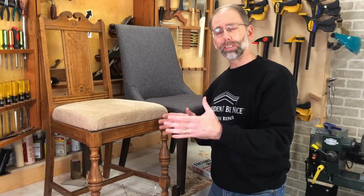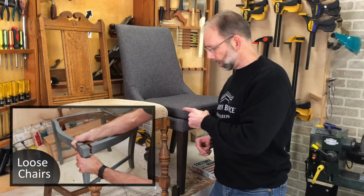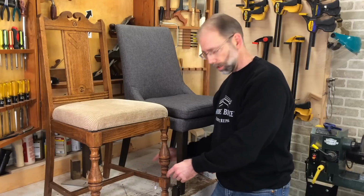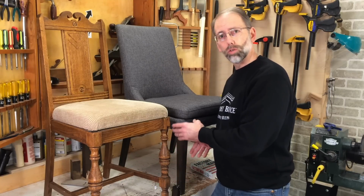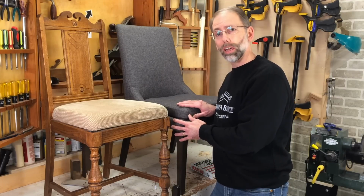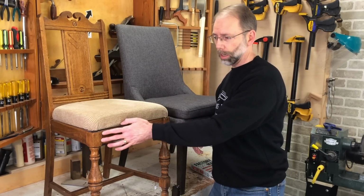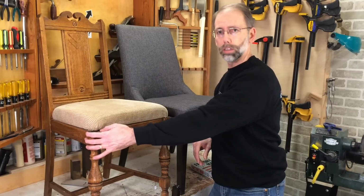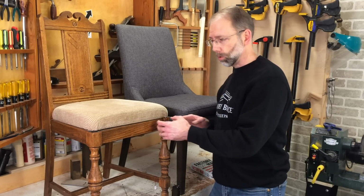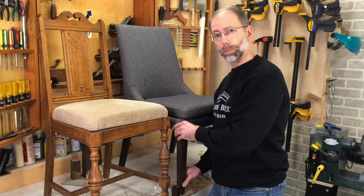It's a simple process that I go through in my workshop and I show how to do that on my YouTube channel. A chair like this that doesn't have any stretchers between the legs to stabilize the leg, this joint is going to wear out and eventually break. So this furniture is not going to last anywhere near as long as traditional furniture. The joinery here in this chair would be dowels on these joints, the same as what we're seeing here. We've got tenons, so the joinery is very similar, but in this particular case, because there's no stability, the leg's going to fail.